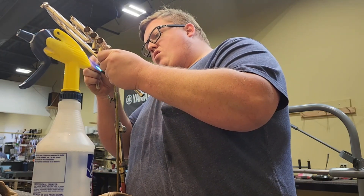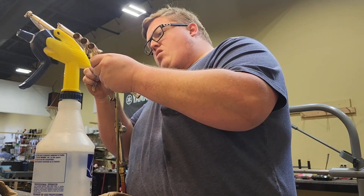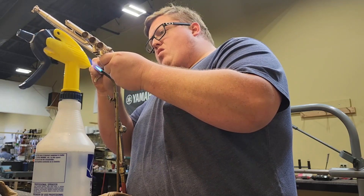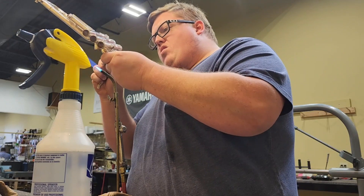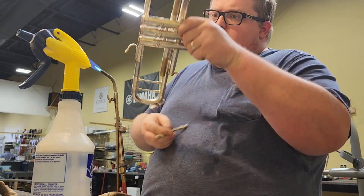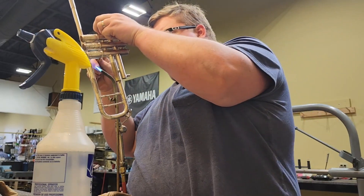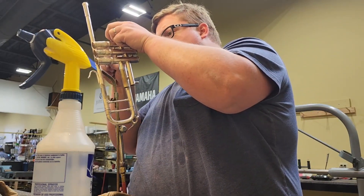I use ultra fluffy pipe cleaners for actually getting into tight spaces because I don't want to stick my fingers in there near the fire — I've already burned myself enough. Just doing picky cleanup work here. The less solder that is left on the instrument, the less buffing we will have to do, and that means the less silver will be removed.